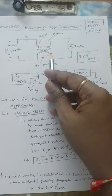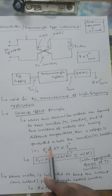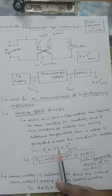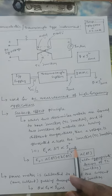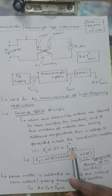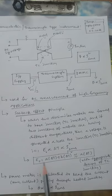To compensate the work function, there is a possibility of movement of charges, and due to this movement of charges a voltage is developed. This voltage E₀ is proportional to ΔT, which is proportional to I²_RMS. Considering Joule's heating effect, we have I²R, where R is the resistance of the material. The actual equation is E₀ = AΔT + B(ΔT)². For an ideal linear design, since B is kept very small so that A dominates, the output voltage is approximately E₀ ≈ AΔT. This is achievable with appropriate thermocouple junction design.